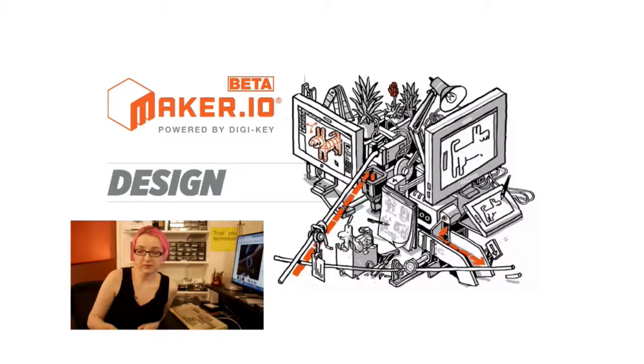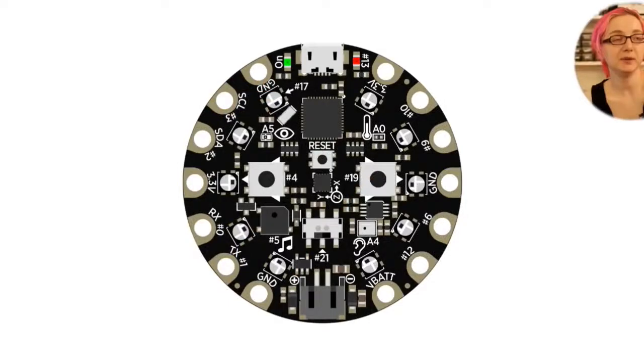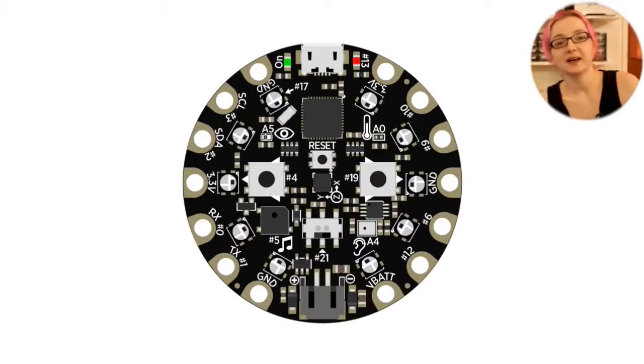And then in design, we laid out all those parts in EagleCAD or whatever your favorite CAD software is, maybe KiCad or OrCAD or Altium or what have you. You get those into your prototype PCB, and it's demonstrated here. This is a drawing of the PCB, but we do the layout and decide our final prototype, which is a little counterintuitive, but you're going to send out PCBs. They're not too expensive, but you want to get it as close as possible to your final design. Get everything you want on there and test points and get ready for prototyping.